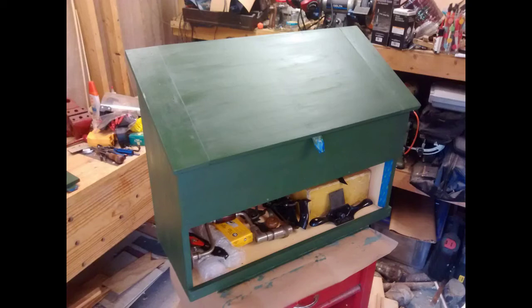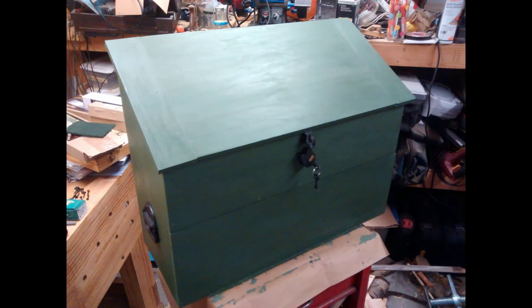So the next thing I did was I tried out some paste wax, and that seemed to do the trick. It kind of gave it that nice satiny sheen that paste wax gives, and it evened out the sheen so it didn't look glossy in some areas and dull in others. I think it turned out pretty nice with the paste wax on it. So this is my final finish with my chest, and I'm pretty happy with it. Thanks for watching.